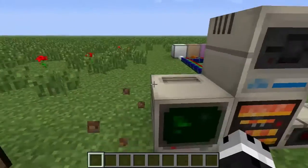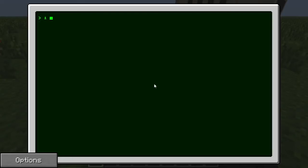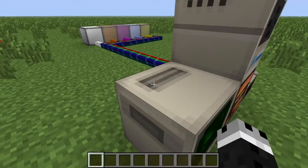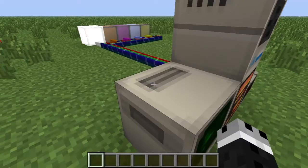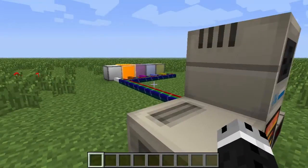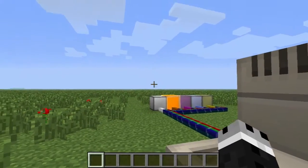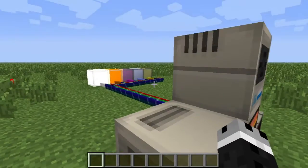Let me show you exactly what I mean. If I type 1 IOX exclamation point, it's going to turn on the white one. If I do 2 IOX exclamation point, it's going to turn off the white one and turn on the orange one. If I do 3 IOX exclamation point, it's going to turn both of those on at once.